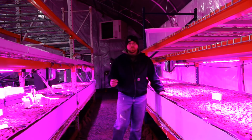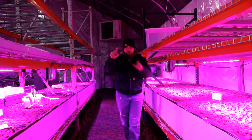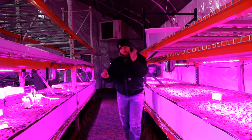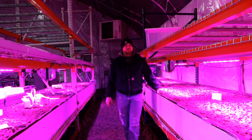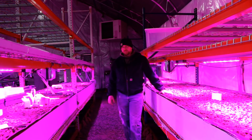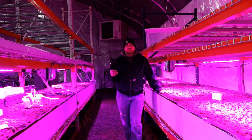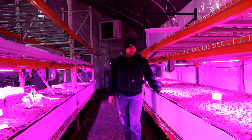It shouldn't be possible because I have a relay that controls each bed — when one fills, it turns off power to that inlet and turns on the next one, meaning it should always empty before moving on. That was the logic. I also hadn't installed overflow standpipes yet, which was stupid in hindsight, but my logic was that the normally open outlet valves would prevent any overflow situation — yet there it was staring right at me.